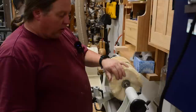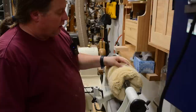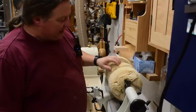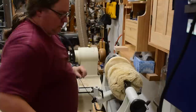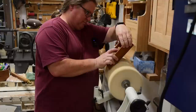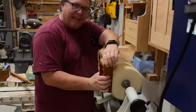You can do it with a little drill and those hand buffing wheels. I've got it set up for wood turning — polishing small turned boxes — with a polishing brown compound over here, a little wax on this one, and a dry wheel to buff it off. I'm not using the polishing one, but I have a little beeswax on this one — little enough that I can't really feel a difference — it's just going to buff it in, and that buffing action kind of melts it past that first layer of grain into the wood.